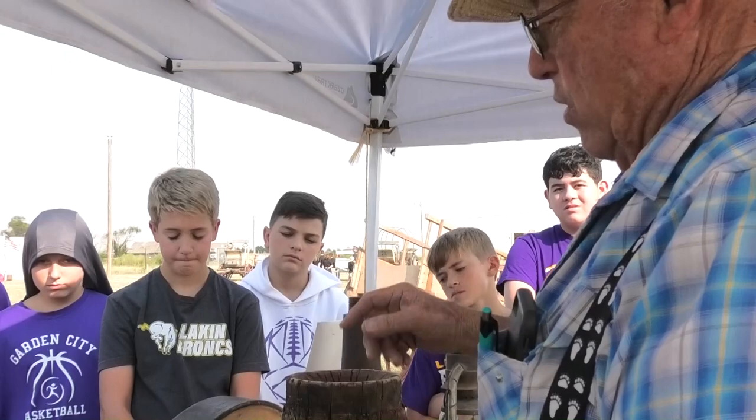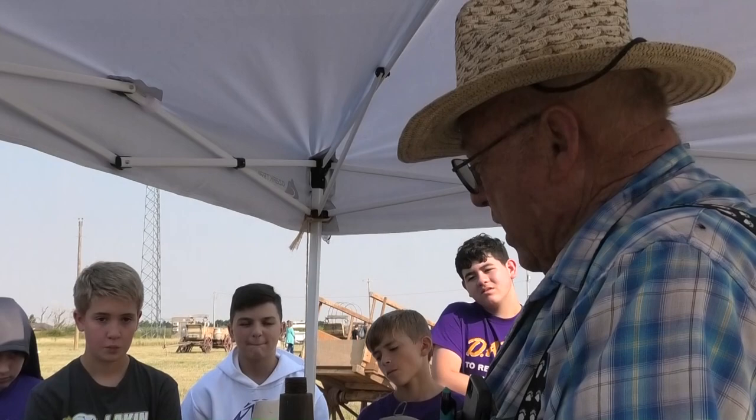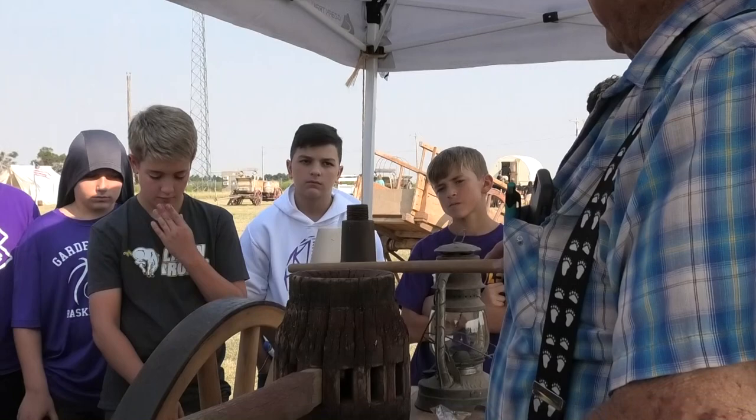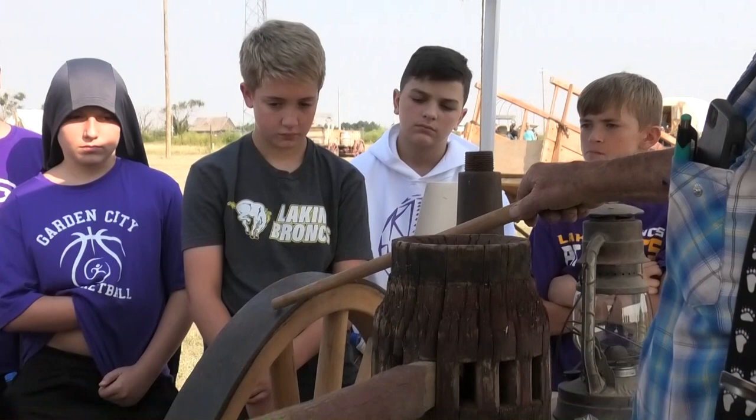So we take what we call a traveler, and you measure all the way around the wooden part of the wheel. Let's just say it's 12 feet around. So now you need to make your tire, and you put it through a roller, and you make it, in this case, 44 inches in diameter. And then you cut the tire so it's 3 inches shorter in circumference than the wheel.